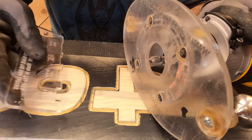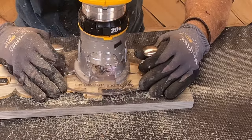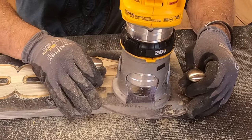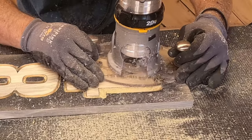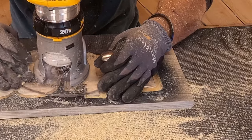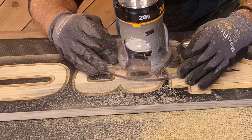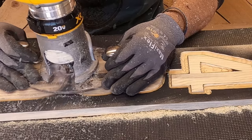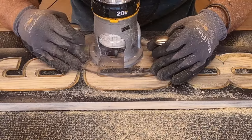The next bit we're using is the new three-eighths 90-degree bit. We do almost all of our background with our regular quarter-inch 90-degree, but this particular bit is new to our arsenal, and me and Dad just fell in love with it. This thing cuts like a hot knife through butter and gives that same look — you can get the same texture, but it cuts your time in half. The only thing is you really got to be careful if you're not used to it, because you will go right through your carving and not even notice it.